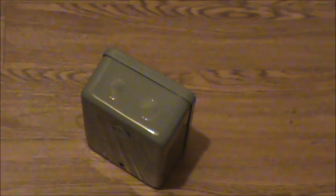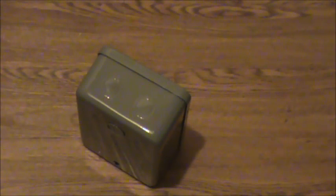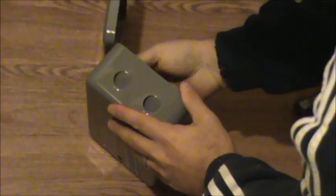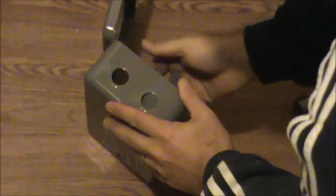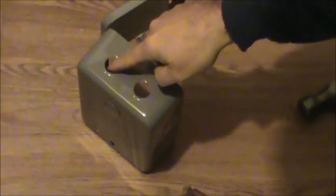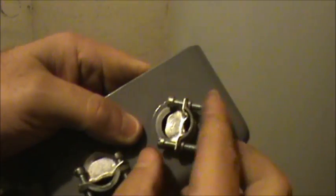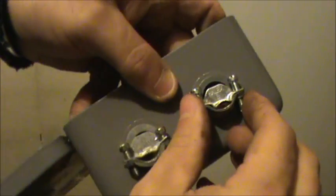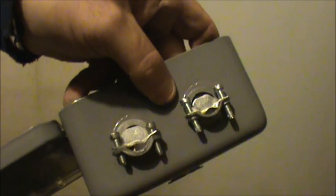On the bottom of the box there are two knockouts, and I'm going to knock out each one. I probably could just use one, but I want a nice clean looking install, so I'm going to run one wire from the heater and one from the panel. In our knockout holes in the bottom of the box, we want to secure our two wire clamps and tighten them up.